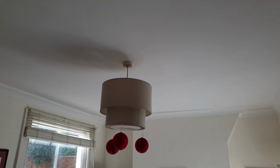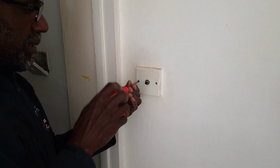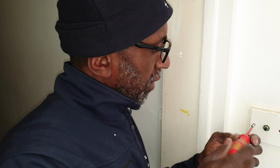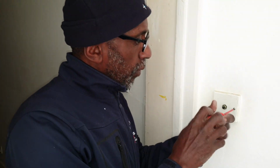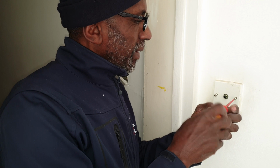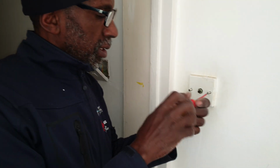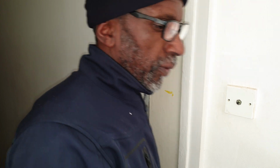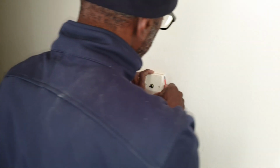What I'm trying to do, I'm trying to avoid taking the whole thing down and going through it. Because that's the only way I can think of anything can be solved, but it's just a matter of how long it's going to take you. You know? When you wire a circuit in a conventional manner, and there's a fault, it's quite easy to find. That's why when I do wiring, I try to have no connections at all, no junctions. You know, I go from there to there. I don't want no junction under the floor if I can help it.